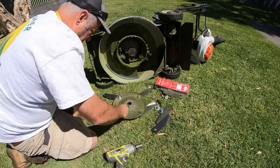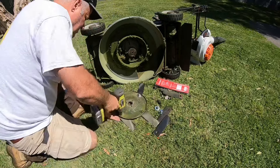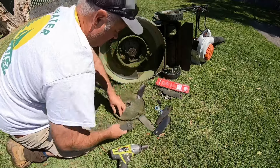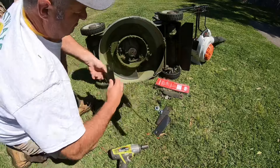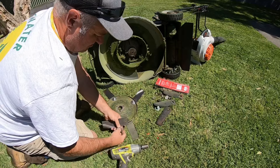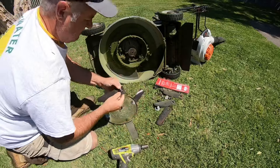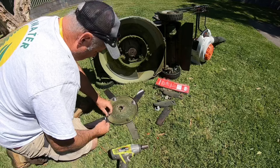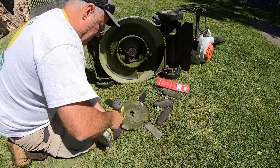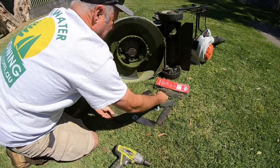As you can see here, there are four blades — two high lift and two low lift. These are called swing-back blades. If you hit anything hard while you're mowing, the blade will swing back from the disc to protect the motor. Some models of mowers just have one big bar underneath. I prefer the swing-back blades — standard threads, righty tighty and lefty loosey, easy to undo.